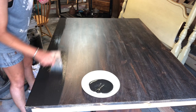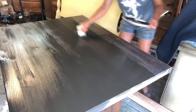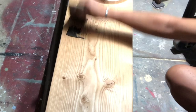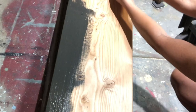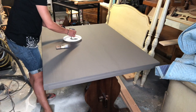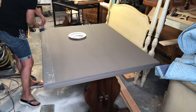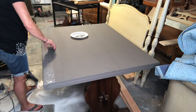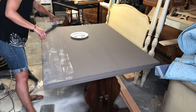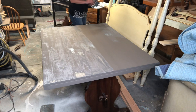We're using the DIY blending brush — it has a coarser finish, which is exactly what we want — and I'm going to give it a coat of Weathered Wood. Let's give the top of our bench some Weathered Wood too. Now I'm gonna take Gravel Road, a really light gray, and dry brush it on. For dry brushing, keep your brush at an angle, use hardly any paint, and make long strokes all the way down. If you mess it up, just keep blending — it'll be all right. You can see it's already starting to change the look and give a weathered wash appearance.